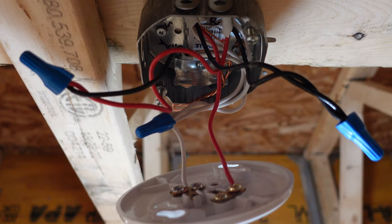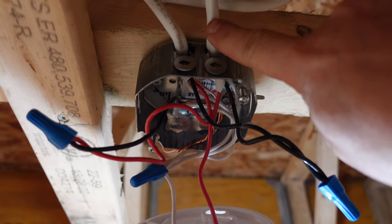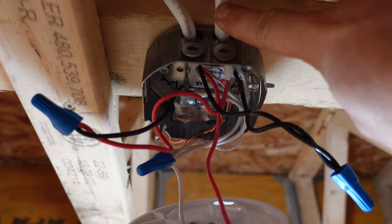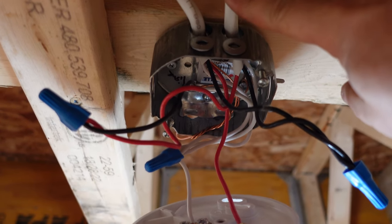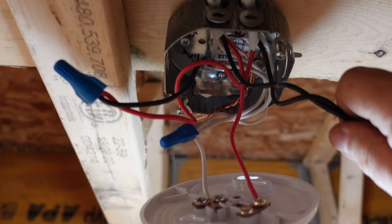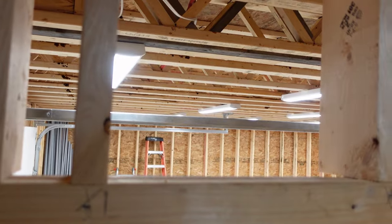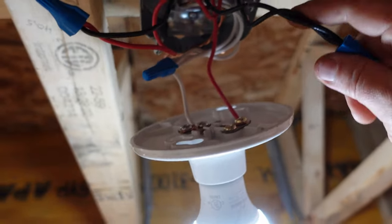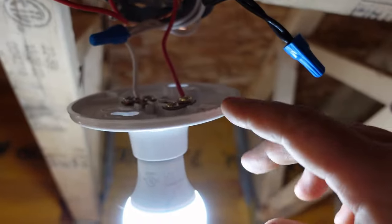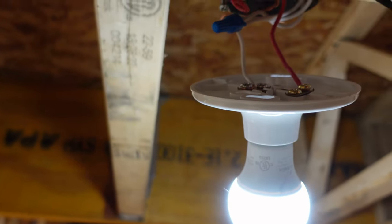This light box can be a little confusing, but I've done this on purpose to show you an example. We have a three-wire — white, black, red, and ground — coming up from our switch, and from that we have going to another source. On this light I have the red and white, and I'm switching the rest of my shop lights on the black. So this black actually goes to all the shop lights out here, and this red actually goes to this light.